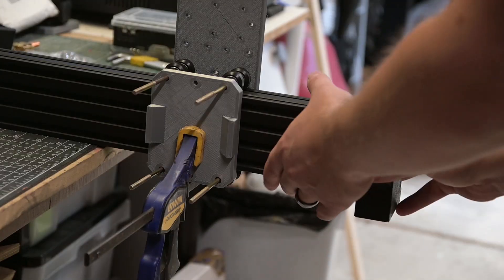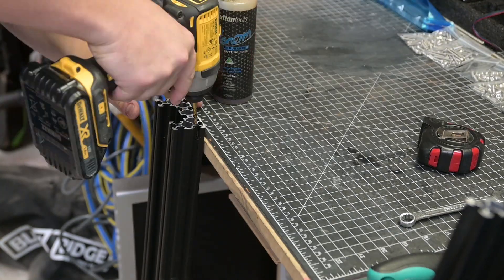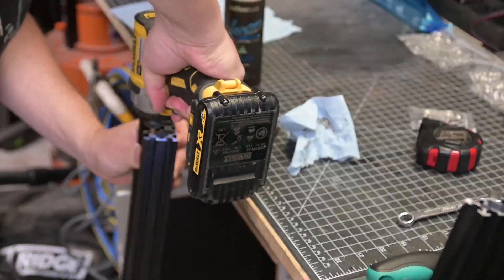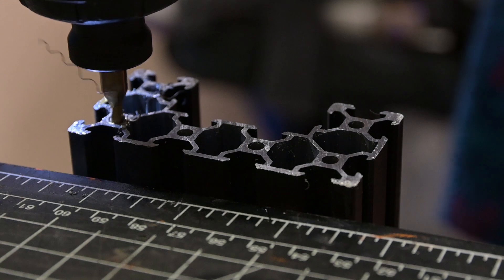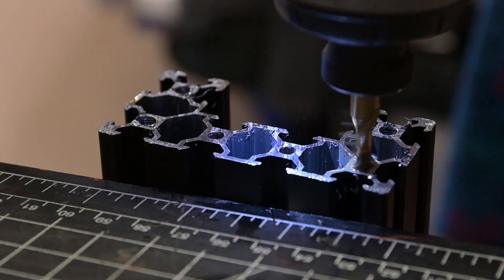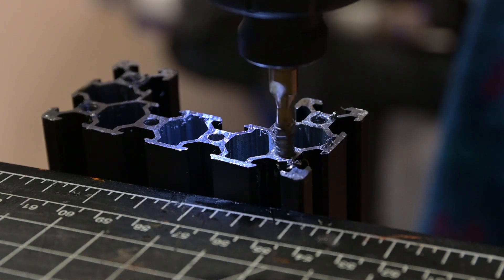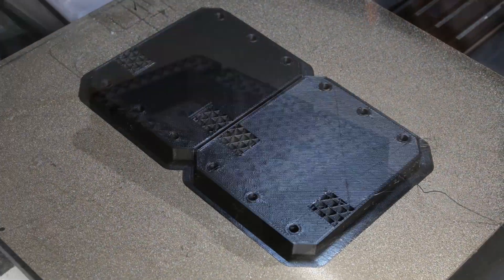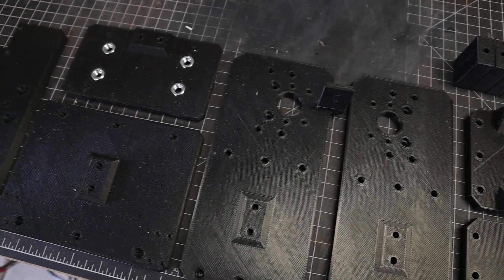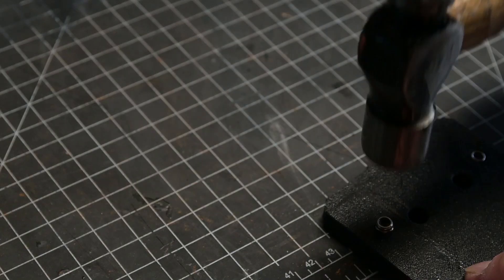Hopefully distributing the cutting loads and not mincing the POM wheels. These feet blocks will go on each corner of the aluminium extrusion to ensure sufficient clearance for the carriages to slide freely. To kick off the build, I'm tapping holes in the aluminium extrusion to mount these feet, or the carriage plates in the case of the Y-axis. There's also quite a few parts to print — I'm just using PLA for now due to the ease in which it prints, and they ended up being much less rigid than I expected.